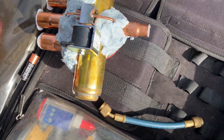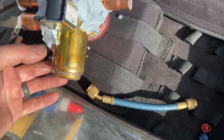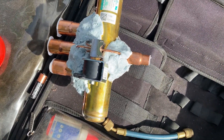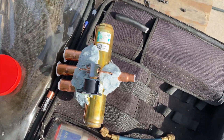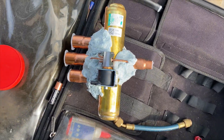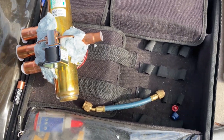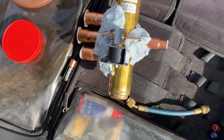We've got our wet rag all over this stuff so we don't burn up the seals inside there. This is the part that's scary about reversing valves — if you overheat it you'll damage the new valve and then you're back to square one. We're going to dry fit this thing and figure out how much we need to adjust and go from there.